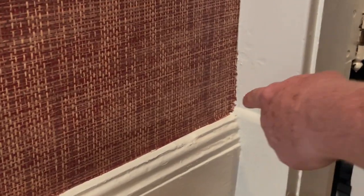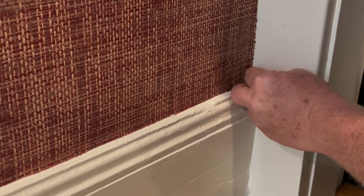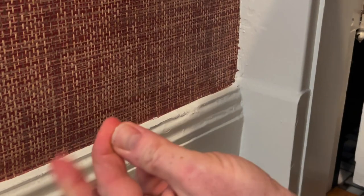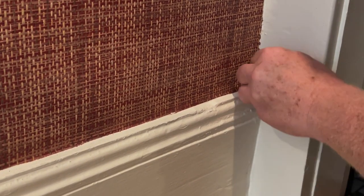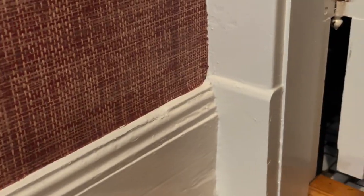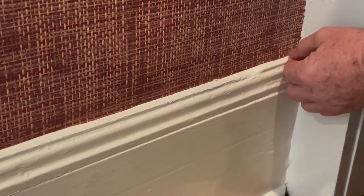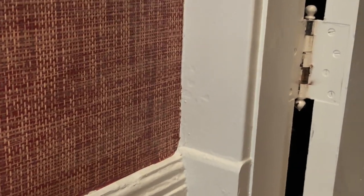How do you like it? You see it's choppy there? So check it out — here's what you're going to do. Take your fingernail and make it permanent. Just clean up with a straight edge, which is your fingernail. And then, if you have any other cleaning up to do, this is what you do: you get the paint for the trim. See, this trim is really old, so it has tons of paint on it and it's not perfectly nice and straight — it has old house charm. So you take a nice paint brush and you paint a straight edge of paint right up against your wallpaper if you have a sloppy edge. I don't have a sloppy edge here, but that's what I would do if I did.